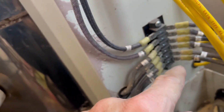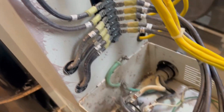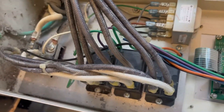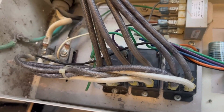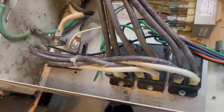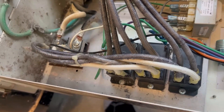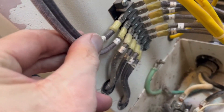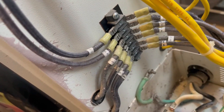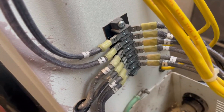One last thing to point out when testing these different pairs: the relays are clicking on in an order determined by the temperature that the Dynatrol is reading from inside the kiln in each zone. It is not consistent. You may have to hold the voltmeter on a certain wire pair for a while — up to a minute — in order to get a reading across those.